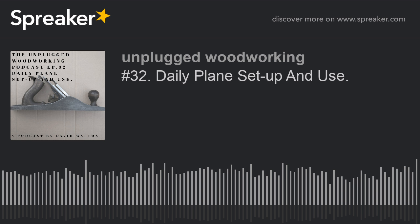So when I'm doing this, it just makes it easier, especially if you've got some awkward grain. I tend to use a lot of oak, so I will get some gnarly parts of the board. For me anyway, it's not very common to get a piece where I can take the plane all the way down and I won't get any trouble. There's always a live knot somewhere in it, so it's always better for me, and again it must be for a lot of people as well, just to skew it, so you're not ploughing into it head on. You've skewed your plane, so the plane iron's not going straight into it like a chisel would. You're skewing it so it can slice it, if that makes sense.